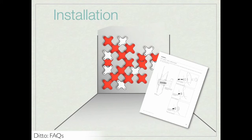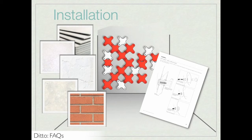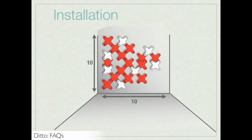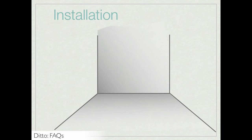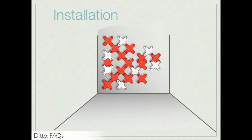Ditto can be connected to a number of wall structures such as drywall, sheetrock, plaster, concrete, or brick, as long as the wall is structurally sound and the contractor uses appropriate fixtures for the wall type. Based on the solution type selected, anchor conditions will need to be specified as well. We estimate that a 10x10 tile wall or partition will take two hours to install, though install time will significantly decrease if the installer already has experience with Ditto. During installation, we strongly recommend replicating the design and pattern of the Ditto tiles on the floor first, then connecting the Ditto together with the hardware, starting in one corner and proceeding line by line. Once the piece of Ditto is fully assembled, then install it into the final space.